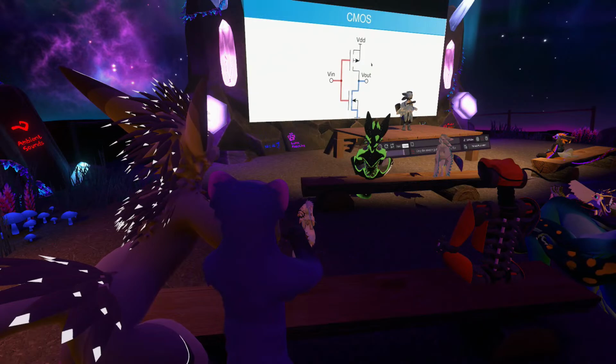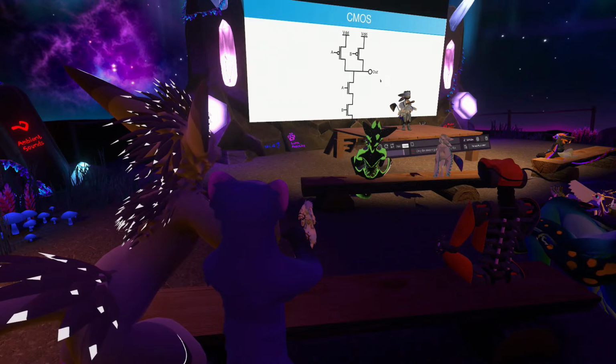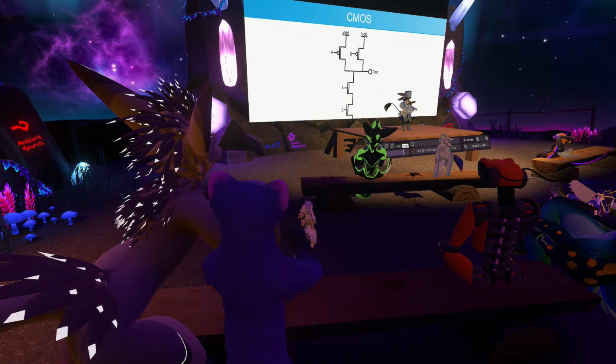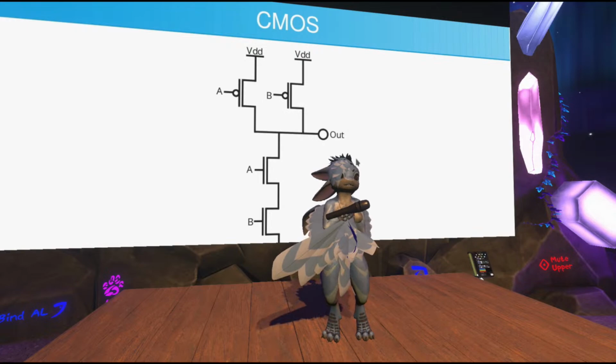I'm not going to walk through this, but this is what a NAND gate looks like, which is a circuit with two inputs and one output. And you see the same thing, it's a little simplified here. You can see the same thing of having transistors trying to pull the output high and some transistors trying to pull the output low. And so you get this complex interplay where the output is always driven one way or another. Physically, this looks like this.